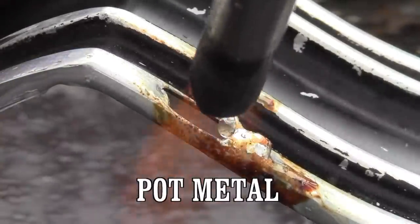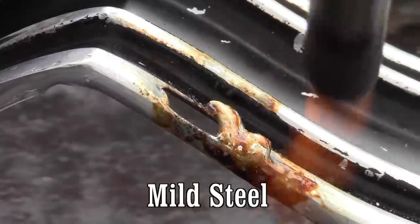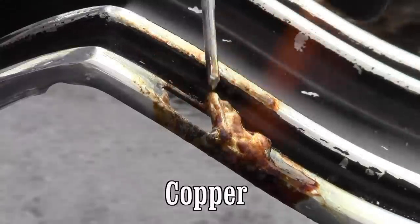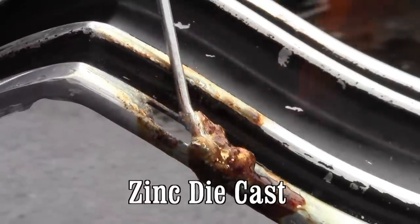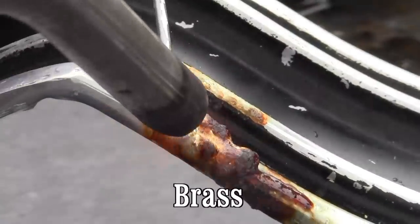It can take 10 to 15 seconds for the rod to cool enough to set up, so we are editing the cooling time. The reason we are cooling between passes is the solder will run thin at higher temperature and could fall through the large hole due to no backing plate. With a backing plate, there is no need for a cooling period.